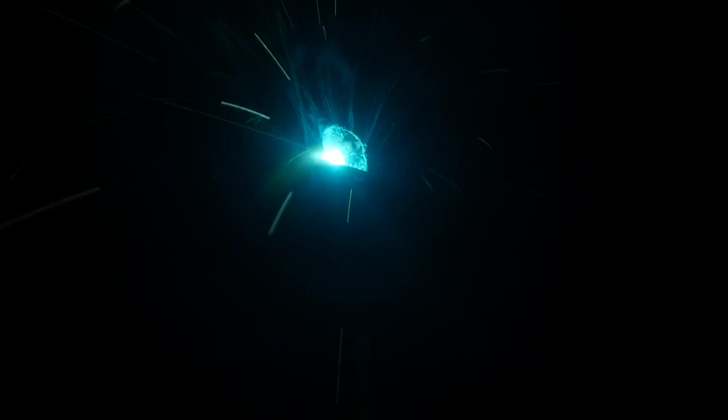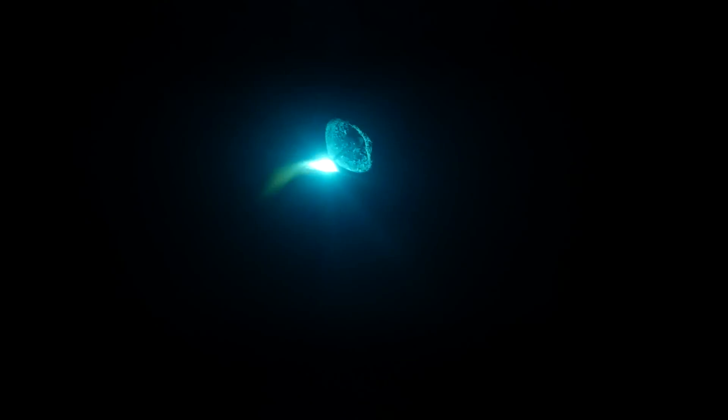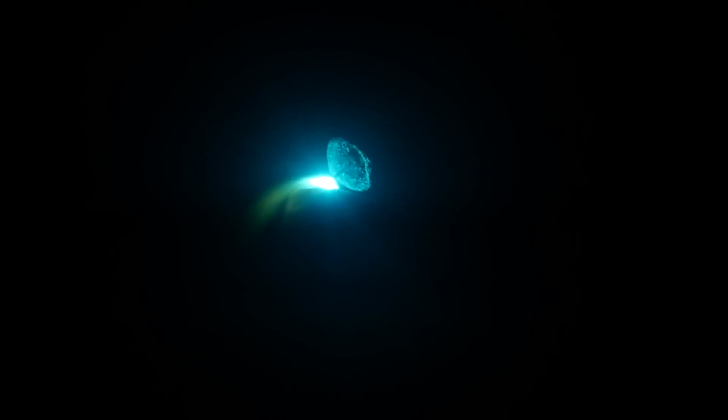When I'm rooting, my positioning does look low, but because it's such a small diameter pipe the molten pool solidifies at 12 o'clock, so you have to be in that position in order to root it. Any higher and you'll just blow straight through, or you'd have to turn the amps down so much that I wouldn't be comfortable rooting at such a low power.